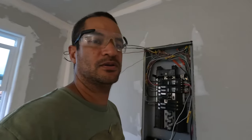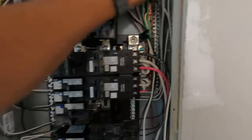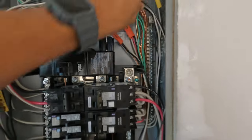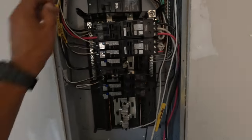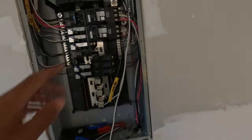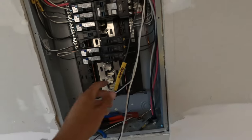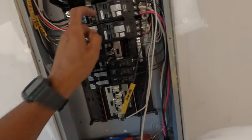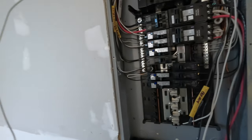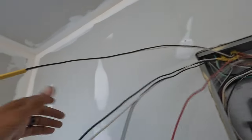We're back. I've been working on this here a little bit, making decent progress. I kind of don't like the way some of this looks, but I have almost all my circuits done — just going down and putting them in one by one. I have all my grounds run separately on this bus bar because this is probably going to be my secondary panel, not a primary panel.